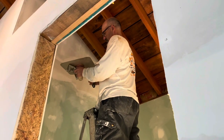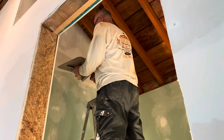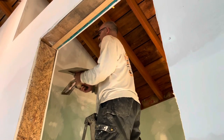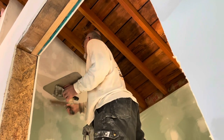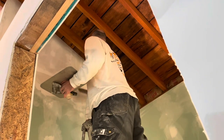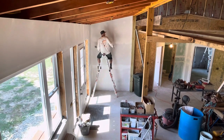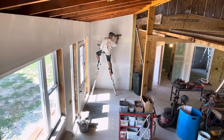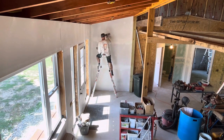The ridges, the dags, anything sticking out — and then after that we would come in with the wet sponge and sand the walls down, knock off all of the dust, and make sure that there are just no high ridges or rough spots left. We would repeat the process three times to get to a level 3 finish.